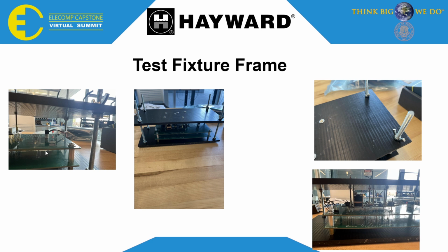And as you can see, to secure the 2 boards stacked together, I used these spacers to make them not move around and make it more precise, because every pogo pin has to hit the board, and if it doesn't, then electrical connection is lost.